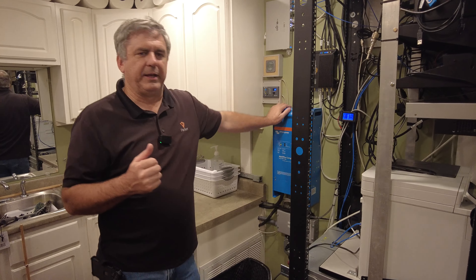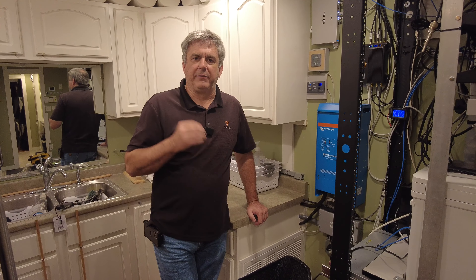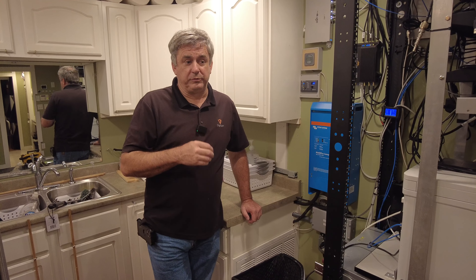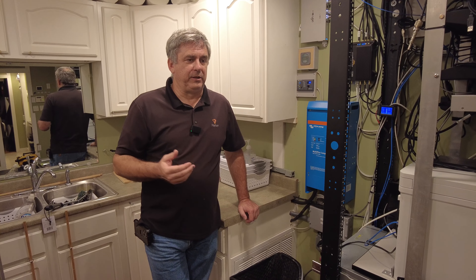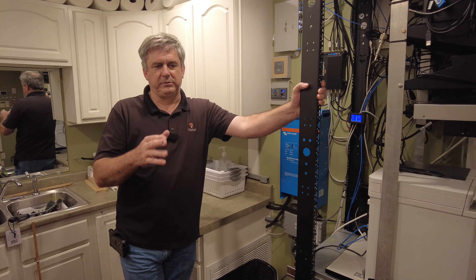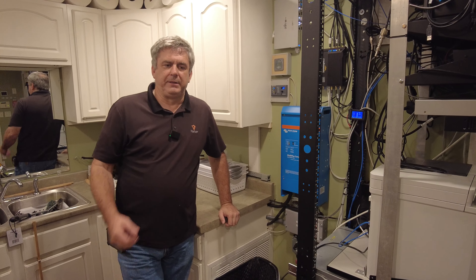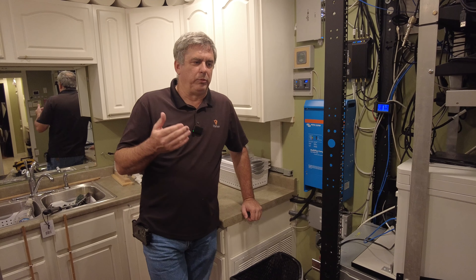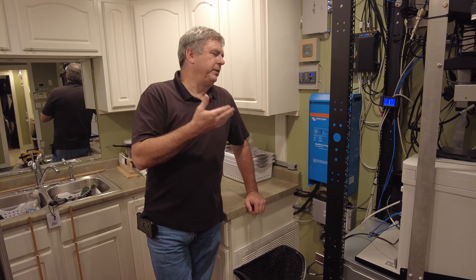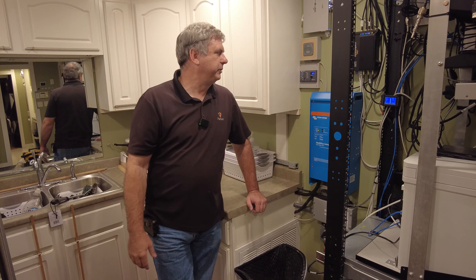For this season, we added four more of those batteries. So today we have 300 amp hours at 24 volts. We've got quite a lot of capacity now, and even with this rack pulling nearly 800 watts and each of the refrigerator and freezer pulling about 300 watts, we can get to a dissipated load of about 1.3 kW. Now we can run for 8 to 10 hours depending on the duty cycle of the refrigeration unit.